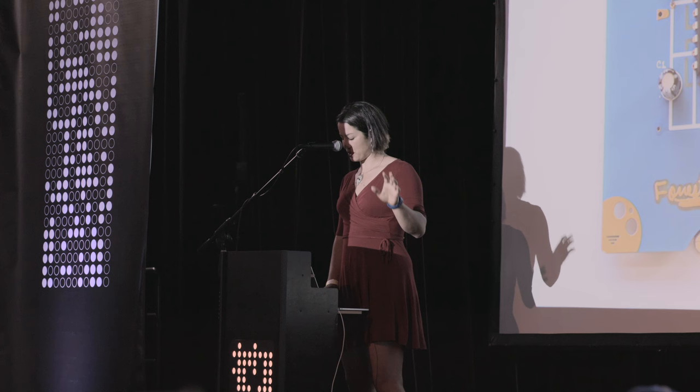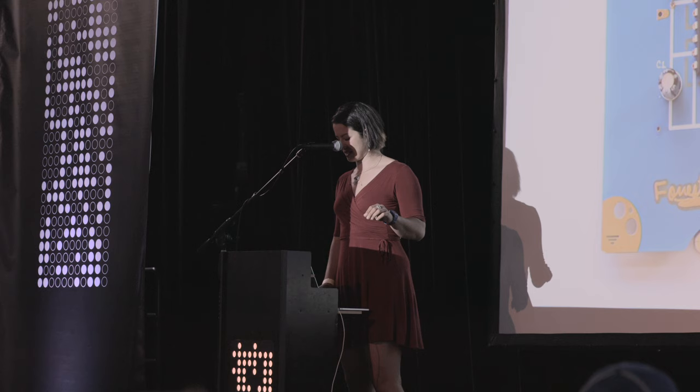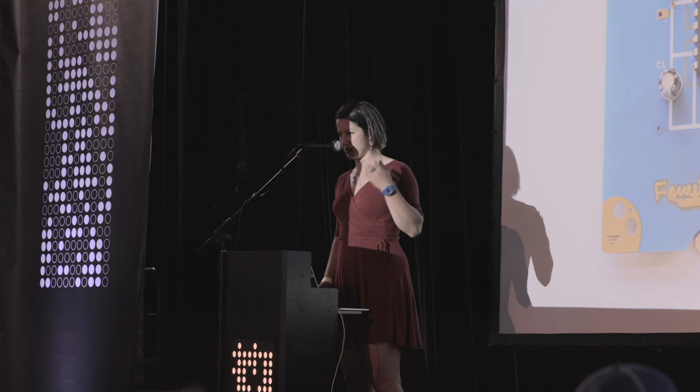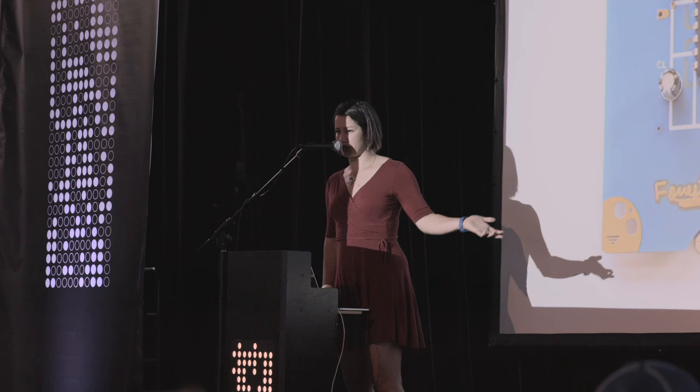Bunch of other things. The schematic that's shown on the board on the far left was traced and reproduced in Eagle using the DXF to polygon technique. There's another thing here which is not immediately obvious, which is texture is part of this board in practice, where underneath the schematic are a bunch of copper buses, basically. So you can run your fingers over it and feel it. Same's true for the logo on the bottom. It just makes it stand out slightly more visually to make it worth it.